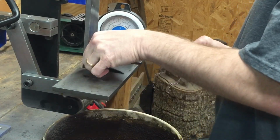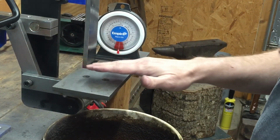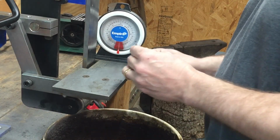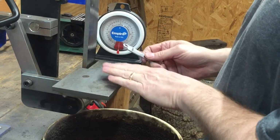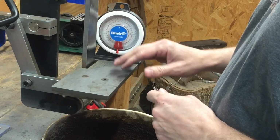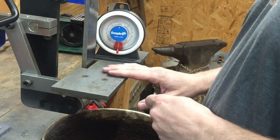Now, before I would use a disc grinder, but my disc grinder burned out and I'm waiting on another one to come in. So, man, hopefully I'll get that thing back, and that's gonna help. But if you just got a grinder and a platen, do that. Make sure that it's 90 degrees, that it's perpendicular, that the rest is perpendicular to the platen.